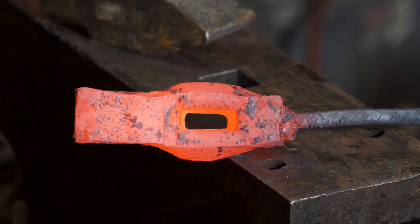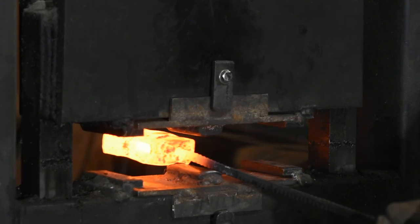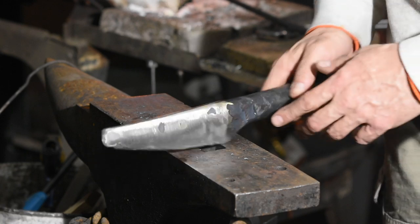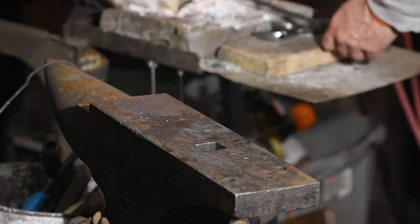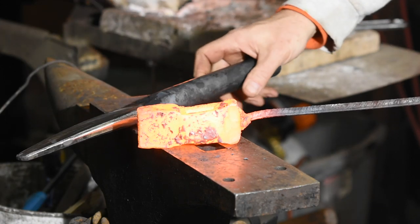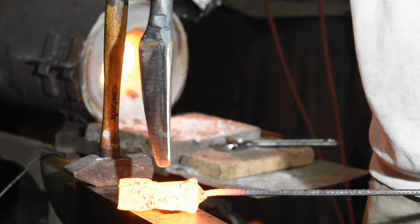And there we are, a nice clean hole. Now we'll turn to a drift. A drift is basically a punch that's shaped to the exact shape and dimension of the hole that you're aiming to produce. Typically axes have a bore that's shaped sort of like an elongated egg, with the skinny part of the egg pointing down towards the edge. You can make drifts in hammer-through form where there's no handle and you just drive them right on through until they fall out the other side — those produce a pretty even hole. Or you can make them with a handle, like I did here, which can only be hammered partially through the head and then have to be withdrawn after each heat. This results in a tapered hole if you only go in one direction, or an hourglass bore when you use the drift from both sides.